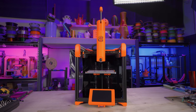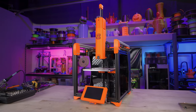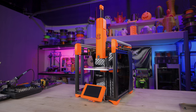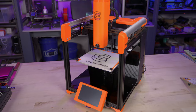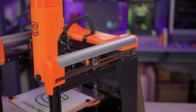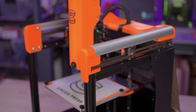With that whole assembly and the syringe mechanism in there, food safety standards come into play. What's been the challenge there? The biggest challenge is how do you clean everything — it's chocolate, it's really messy. With this printer, the chocolate only touches four components, and they can all be washed in the sink and removed from the printer without any tools. There are two stainless steel pieces — the nozzle and the body of the cartridge — plus a polypropylene plunger and a silicone baking mat. That's all the chocolate touches. They can all be removed without tools and washed in the sink, so it's actually relatively clean and easy.